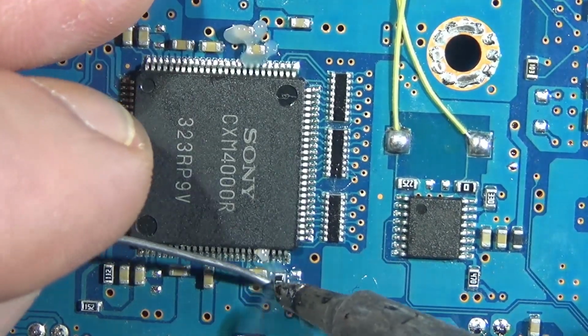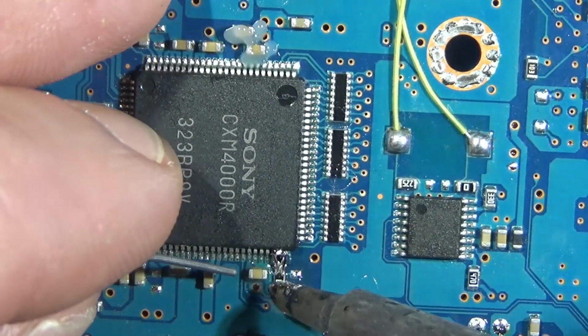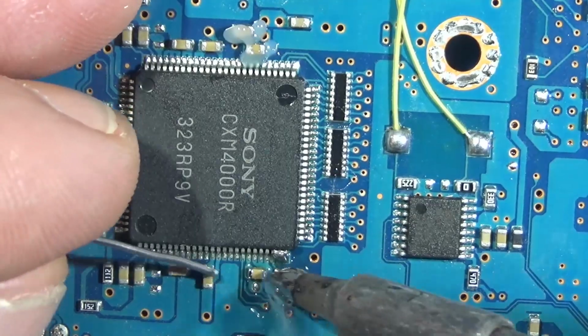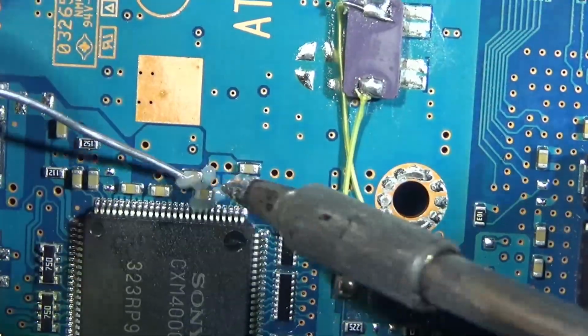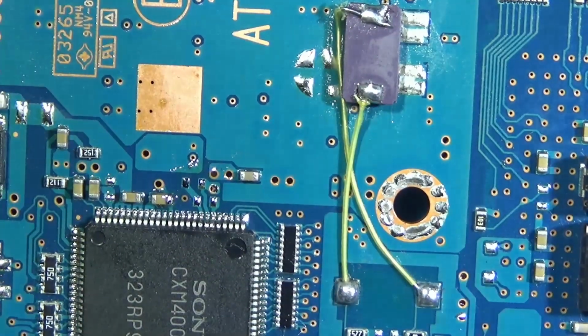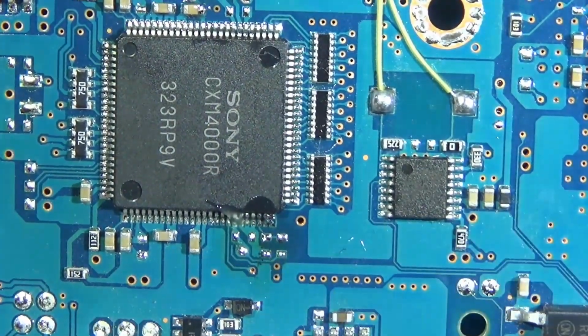Well, alright ladies and gentlemen, we got this at 400 times speed. I'm going to chime in here and there. We are removing some components. As you can see, I am bridging up those pins on the DAC there. We got quite a bit of bridging, which is going to be a common thing, and I'll show you how I deal with it. So we flux it up.